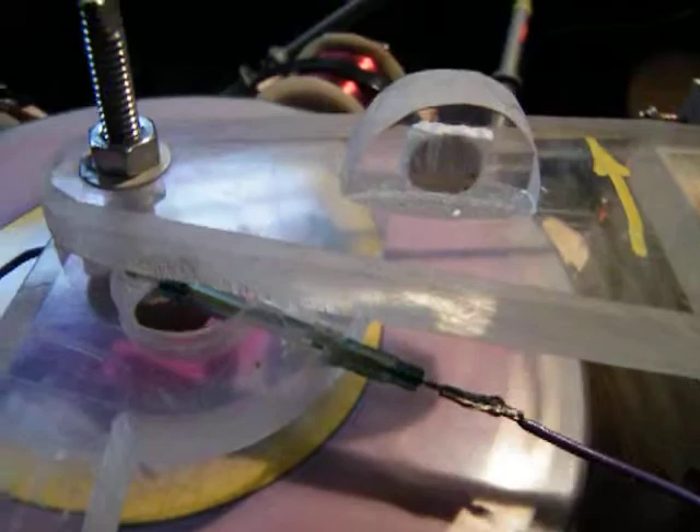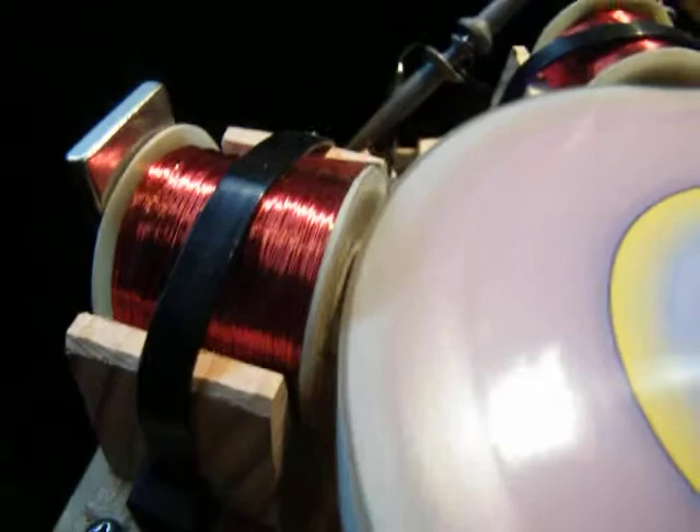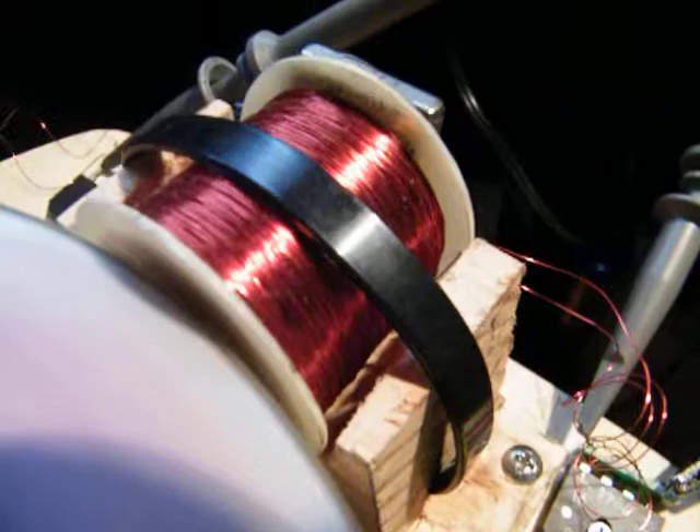This particular magnet is just an experimental development. Over here, magnets assist in the generating coils. They actually speed up the motor and reduce current draw by countering some of the magnetic effects going on between the coils and the magnets in the flywheel. The flywheel has five magnets behind this safety tape right now.